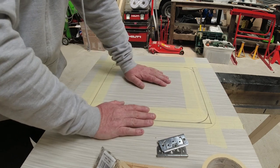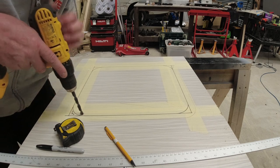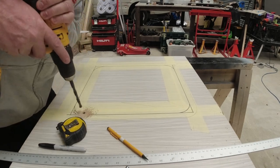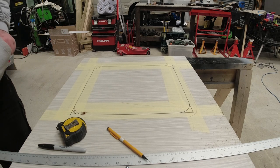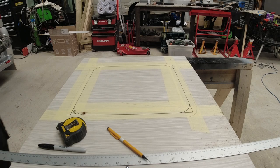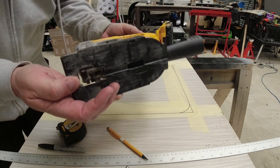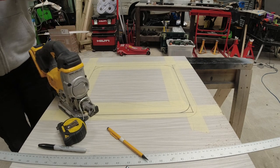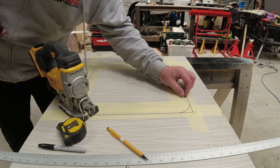Right, so there's one door there — what I need now is to drill a hole and get the jigsaw out. Now in here I have a very small blade, purposely set for going around corners, but when you're going along a straight line it doesn't cut very straight. So when you're cutting with the jigsaw and one of those blades, take your time. If you don't, you'll end up with curves — you're going to get a certain amount of curve anyway, but that will be covered and compensated with the trim we put on the inside.